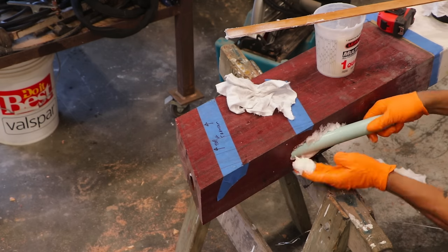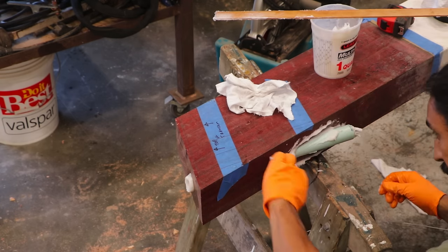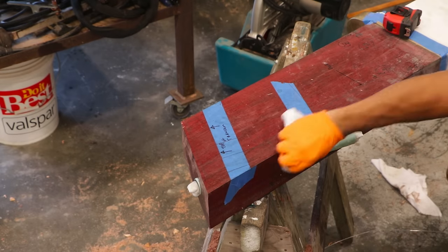So before we installed that G10 tube, Dylan took it on his lathe and he milled a recess in one end of it to accommodate slipping a Delrin bearing into that. So that trim tab shaft will go all the way from the trim tab up through that hole, through the G10, slide through that upper bearing, just a single top bearing, and up through the top of the rudder head.